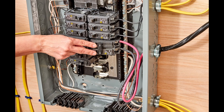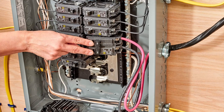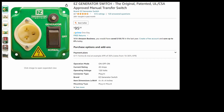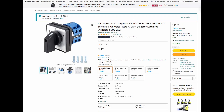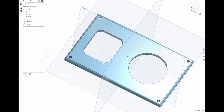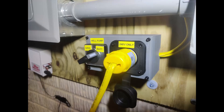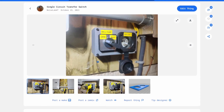There are a few things that warrant mentioning. This setup would require opening up your breaker box and pulling out the well pump's wiring every time the power goes out — that works, but it's a pain. The standard solution is to install some sort of transfer switch, a simple mechanism that allows you to pass through either grid power or backup power to a given circuit. Any of the commercial options would work perfectly, but they're unreasonably expensive. So I came up with my own: I bought a power inlet and a changeover switch and modeled an enclosure for them, which was sent to the 3D printer. Here's the finished result — it's not perfect, but it works as well as any other transfer switch. Total cost came to a little over $25 with filament.